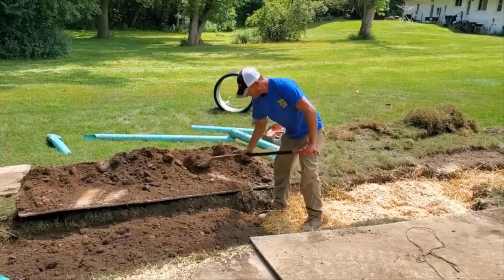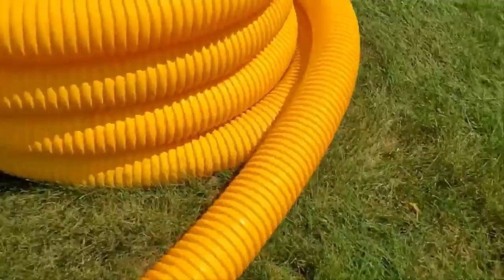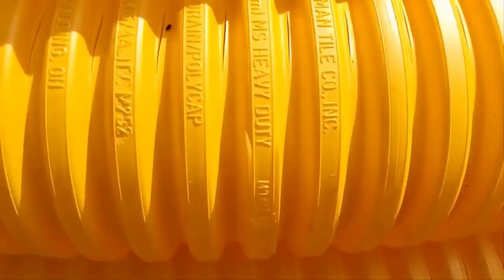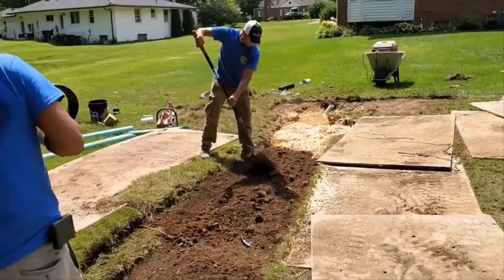Now, this five finger, say I had a sump pump that ran all the time and the soil wasn't very good for percolation. It didn't percolate very well at all. Well, we would go off kind of on a wagon wheel with these, and we would do several of these five-finger leach fields. Whatever it takes, you can bring in enough stone, you can remove enough of the existing soil, and then you add enough chamber, and that's key, that knife cut right there, those are chambers. And then it can slowly leach into the soil. If the soil doesn't take the water in all right away, it'll stay in the knife cut. It acts as a chamber, and then it just sweats. The pipe just sweats. And as the soil will take more, the water just runs into it.